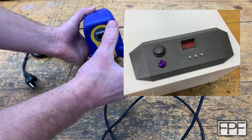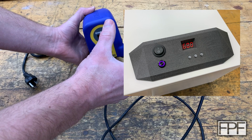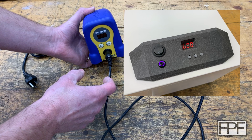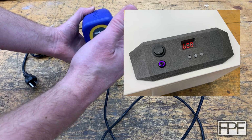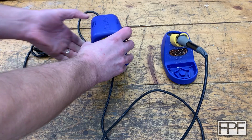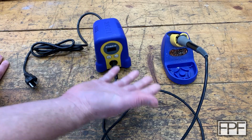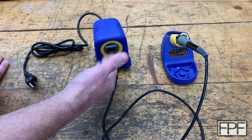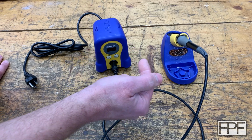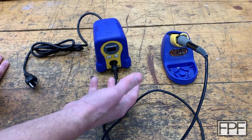It's just like an IKEA steel frame box with a 3D printed part on the top that has the timer board integrated into it, and you flip it on, the board powers up, push a button, and it starts counting down. And while it's counting down, the relays are closed. Actually, you can wire it normally closed or normally open, but the relay stays in that position after the button's been depressed for a set amount of time.